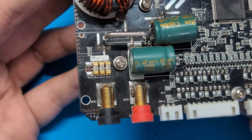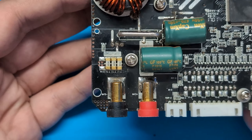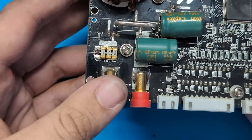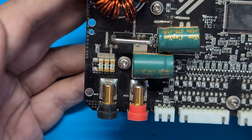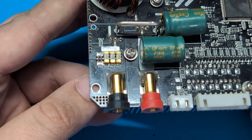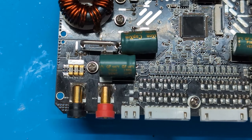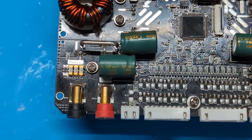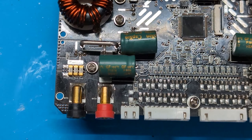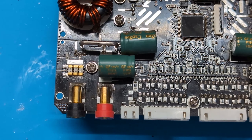These are 15-amp fuses. There are three of them on the 30-series chargers and four of them on the 40-series — 30 and 40 amps respectively. The fuses give you 45 and 60 amps depending on which charger, which is about a 50% overhead, but it's pretty easy to actually go over that and blow the fuses. The customer on this one said they were at about 0.7 volts on the main output leads and they ended up shorting somehow, and that was enough to blow them.